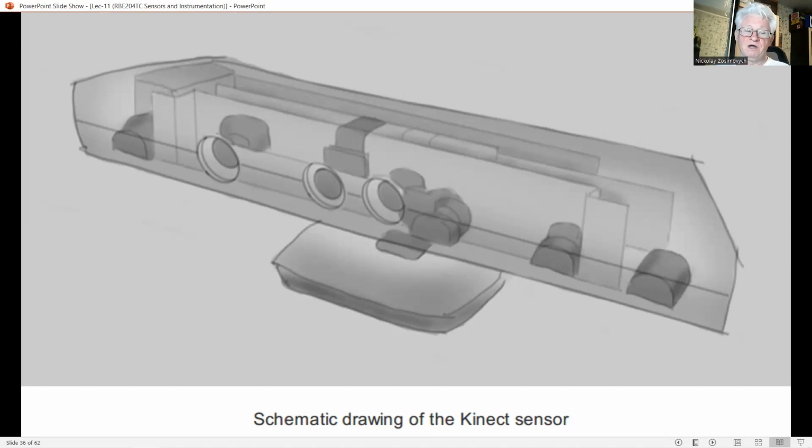The Kinect sensor projects an infrared point grid onto a given scene. This scene is captured using a normal visible light camera, as well as a camera sensitive to the infrared spectrum. Both image sources are combined to recreate a 3D model of the captured scene. For human motion and position detection, part of the recreation in software is aided by using skeleton models to predict human stances and moves.